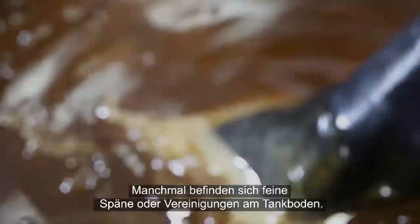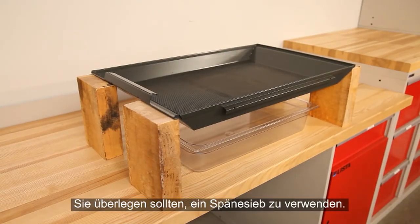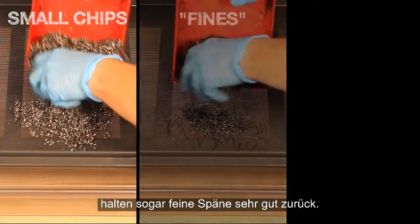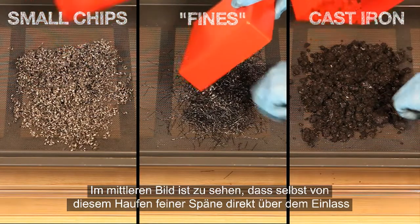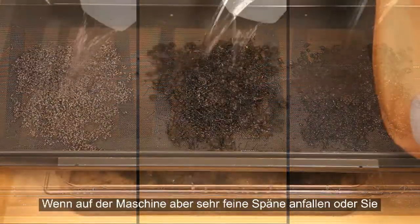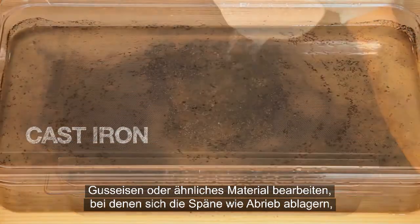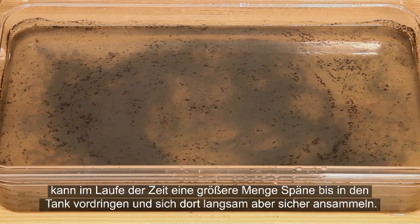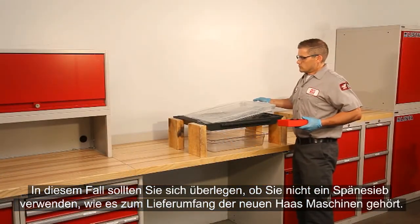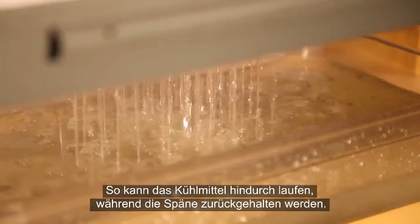Sometimes, really fine chips or sediment-like contamination can reach your tank. Let's take a closer look at how the coolant inlet panel works, and when you need to consider using a chip strainer. The perforations on the coolant inlet panel are very small and do an excellent job of retaining even fine chips. Even with a pile of fines sitting directly over the inlet area with coolant passing over them, only a small fraction of the chips make it into the pan. Despite this, over the span of many weeks, if the chips on your machine are extremely small — or you are machining something like cast iron where the chips form a grit-like substance — then a larger quantity of chips can make it into your coolant tank and gradually build up. In this case, you should consider using a chip strainer like the ones that come with your new Haas machine. Stretched over the supplied chip basket and placed above the inlet panel, it allows coolant to pass through while keeping chips from entering the tank.